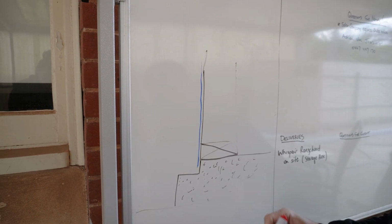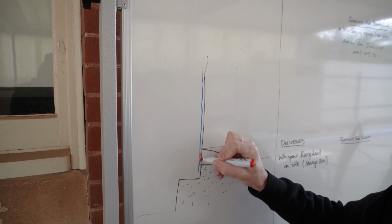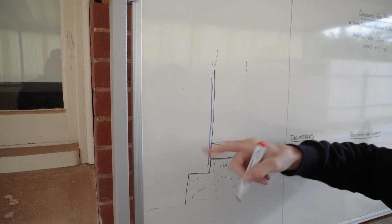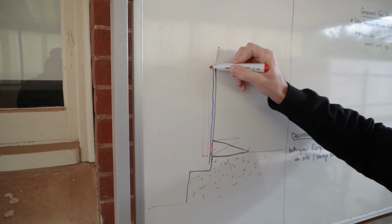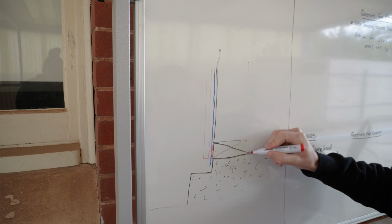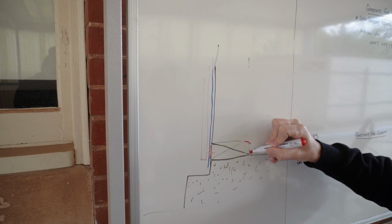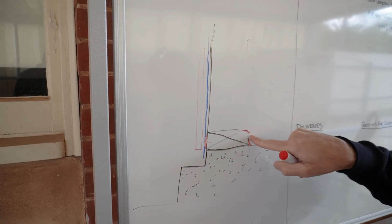What we've then got is the guys are going to put some Orcon sealant in behind the wrap on the face of the wall plate there, and then there'll just be some fixings in here. On the outside of this then as well, there'll be our counter batten. We'll go on the outside for our cladding to be installed on, just rubbed out the wall frame there, but you get the idea of it. And then on the inside, to make sure we've got nice airtight seal as best as possible as well, we're going to have a bead of polyurethane on the inside from our concrete junction to our wall frame on the outside here.